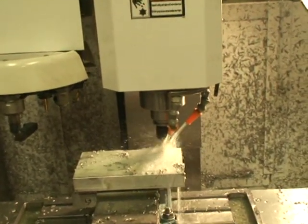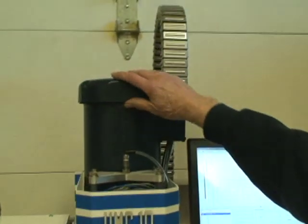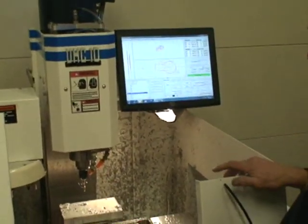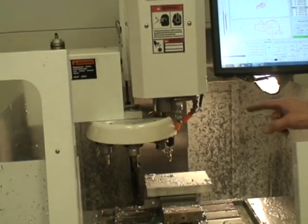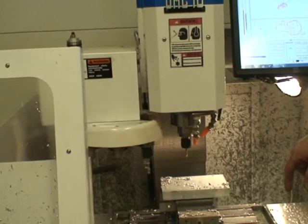Why it's noisy is this motor is an enclosed, drip-proof motor, so it has a fan up here. When this spindle's going 6,500 RPM, this motor's going almost 11,000 RPM. You'll hear the air blast when it comes over here and blows the chips off the tools.